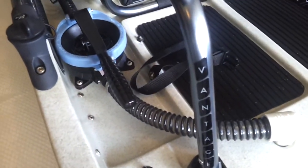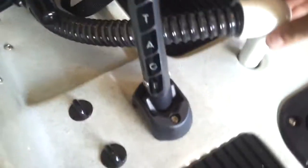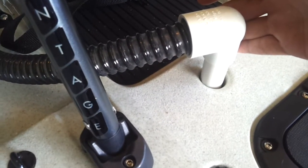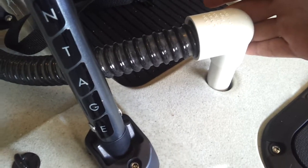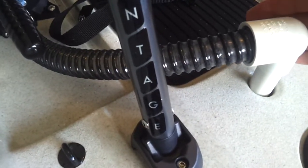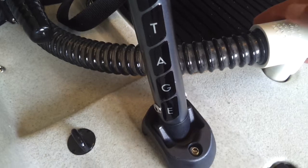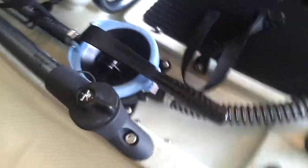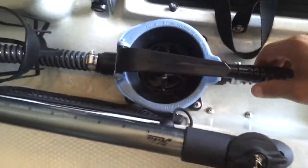The layout of the 12 is just a little bit different, but I've got a 3/4 inch intake pipe here, that PVC fits through the scupper hole, and this goes into this rigid 1-inch plumbing hose that I got from West Marine. It can back down on itself without creating a pinch in the line there, on into where the pump is.